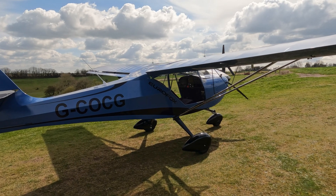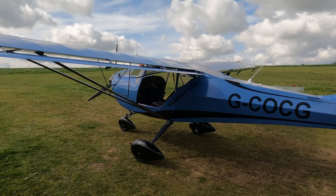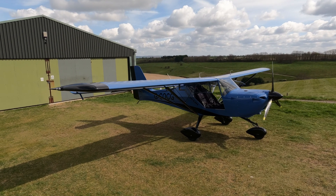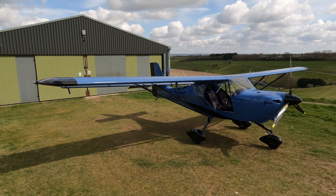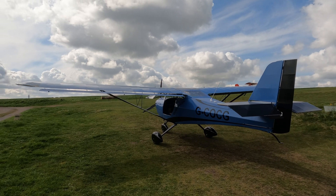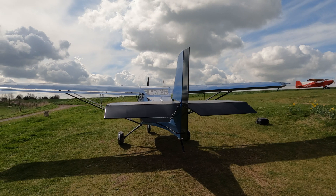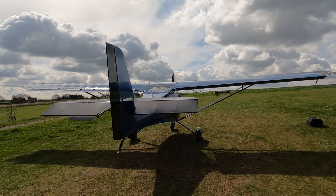The construction of the EuroFox is relatively conventional with a fabric-on-metal space frame — very similar to the Cub or the Kit Fox in design. It has four full-length flaperon runs combining the function of both flaps and ailerons. In common with the Cub and Kit Fox it's incredibly agile whilst remaining forgiving, stable and predictable. It's available in both tricycle and tail-dragger configurations; I chose tricycle as it's statistically safer, allows operation at higher crosswinds, and gives better forward visibility. When ordering you have control over every aspect of its design and can choose the colour of every part, though EuroFox discourages black wings due to heat absorption issues with the fuel tanks housed in the wing structure. I chose the black and blue design with plain black decals.